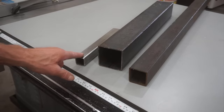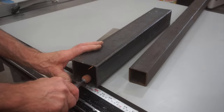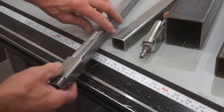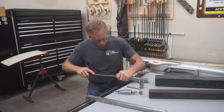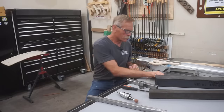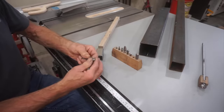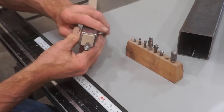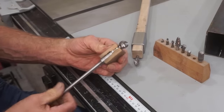For a cleaner, faster, and repeatable process capable of removing weld from tubes of any length whether the weld seam is centered or not, a grinding or cutting action would be required. It's doable with short pieces of tubing because you can reach in and grind from both ends. Once I get a conundrum like this stuck in my head, it's difficult to let it rest until I come up with a solution I'm happy with. What first came to mind is this set of solid carbide burrs, which are capable of cutting weld but are difficult to keep in position. The light bulb moment was when the idea of using bearings to hold the cutter in position within a snug fitting block of wood could solve the problem. It took a bit of detailed designing to refine the apparatus, but it's an elegant solution for this age-old problem.